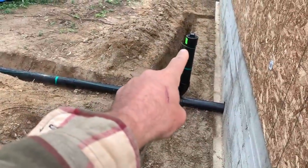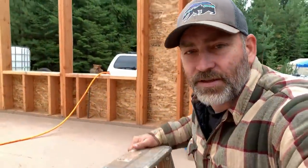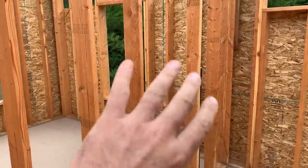We actually did a little more than we really needed to. That blue tracer wire down there is important and you need it, but we did not need the green tracer wire — that was extra. You need that for some sewer stuff, basically if you're doing a pump system where you have to pump water somewhere. He said if you can run a snake down the pipe, you don't need a tracer wire. I asked him about my plans for venting — running it up and across and then up by the peak of the roof — no problem with that.